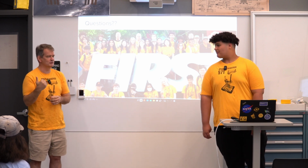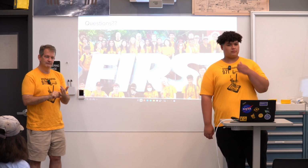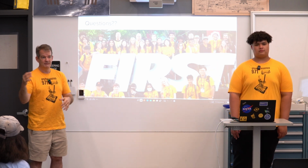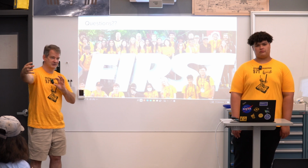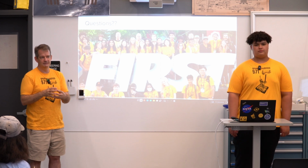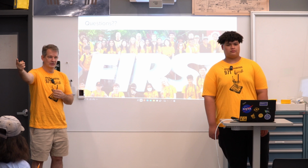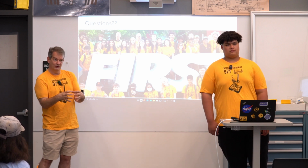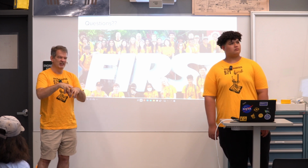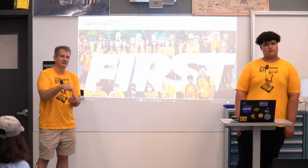I think he's going to talk about how he fuses all the information, but we essentially are running effectively a Kalman filter, which is fusing our IMU data, our drivetrain data, with the images. So the images come in, and it gives you an estimate of where you are on the field. It's giving you a position estimate, and we fuse that in. Basically, the way I tend to think of it is an estimate of where I am in the world gives me a ball of uncertainty of where I think I am. And I have the robot in some place, and it's got some knowledge of where it is. And we intersect those two, and our newest estimate, the revised estimate, is in the intersection of those.